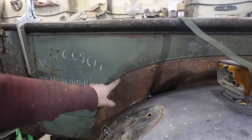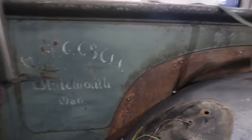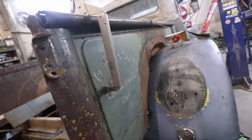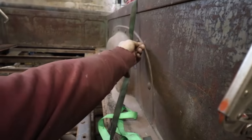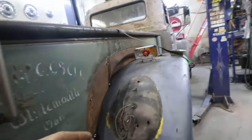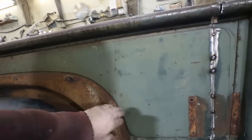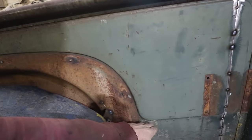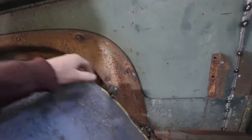This thing that bugs me, I'm looking at it, and like I say, it's a bunch of work, but I'm gonna do it anyways, because it should be fine. I'm thinking I'm gonna just do a cut. I'm gonna slice this all along, that way I can pinch it flat, butt weld it, and it should be a pretty seamless seam after. And then I can leave this down here, or I was just gonna put my line and just disappear into the fender down there.